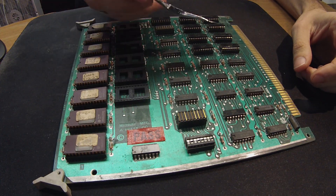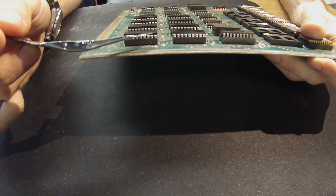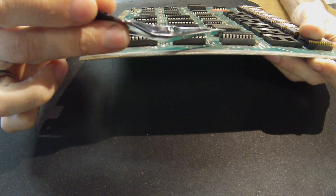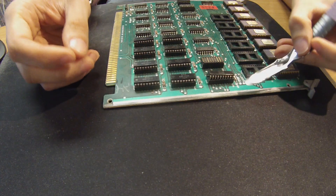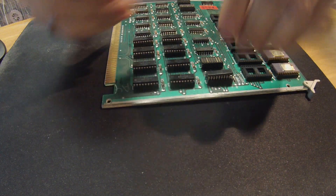There's another set of chips on this board — smaller chips on this side. You can actually see it in the video pretty well how shiny these are, and this chip here is pretty dirty. So we're going to re-seat this one also. In cases where the chips are very dirty, you can actually remove them completely to clean them better. We're going to take this chip out completely and you will see how thin these legs are.